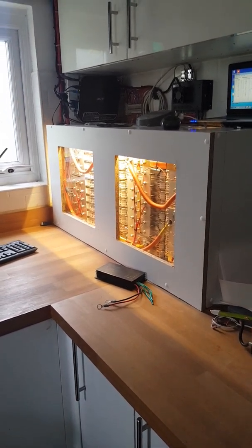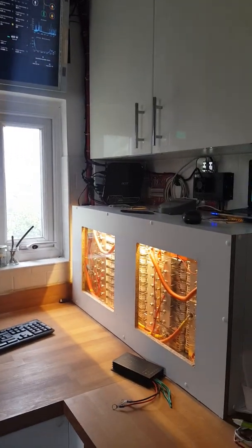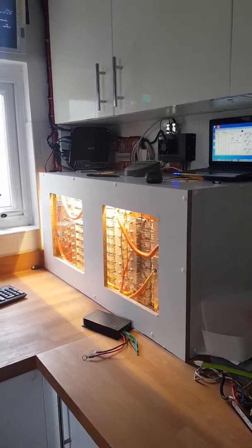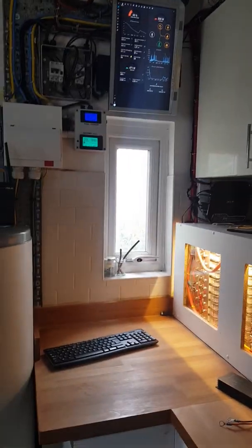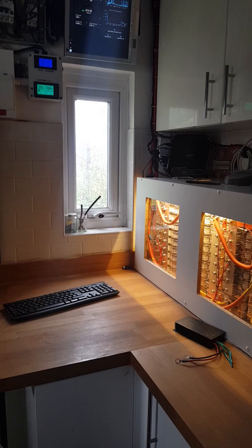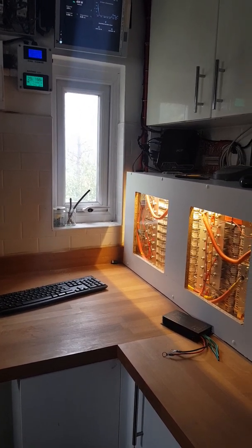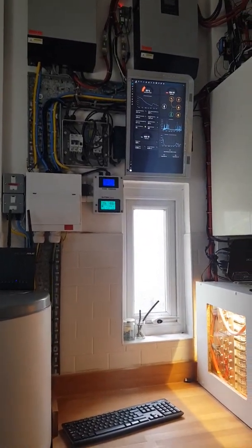So about £1700 for under a couple of grand worth of 24kWh inverter capacity, plus around £800 for the BMW battery pack, the BMS was roughly £250–300, and the rest is really wiring and a £35 computer. You can start to work out that the ROI for this whole system is probably three to five years, if not less — especially the way energy prices are going, potentially towards a pound per kilowatt hour. The system now handles hot water, overnight storage, solar during the day, and electric panel heaters.